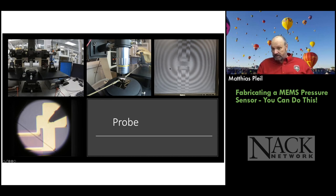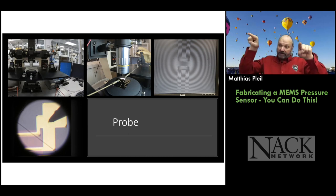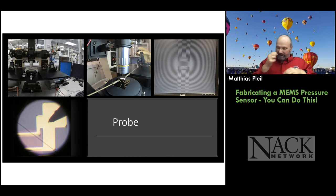And you can see it's circular in the middle, but as it gets closer to the edges, it deforms because your boundary conditions are your membrane's fixed at the edges of the square. So you have a membrane on a square frame, which is kind of strange, right? It's not like a drum, but it's square. And then you can see the Wheatstone bridge is bending along with this membrane, but you see, wow, there's a phase shift here. Well, that tells you how thick the metal is. So that's about 100 nanometers as well. So you can see where it's dark here, it's bright here, because you've got a quarter wavelength difference in path length. Okay, so that's how interference works.